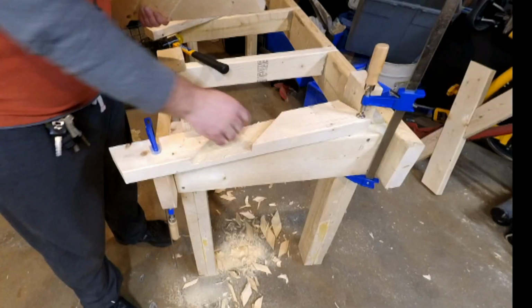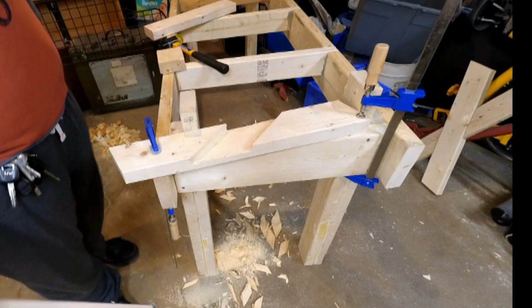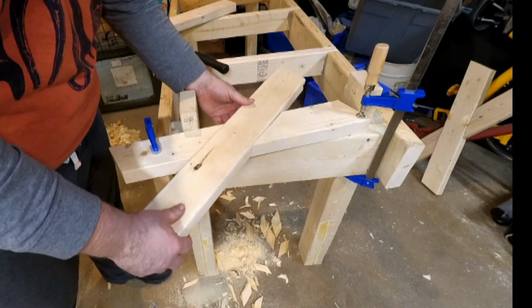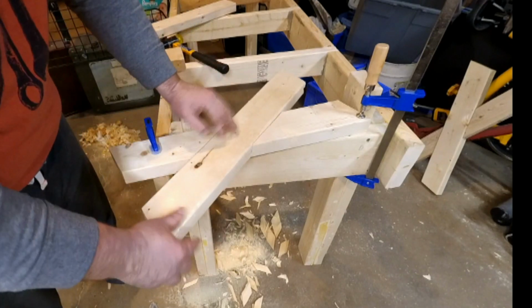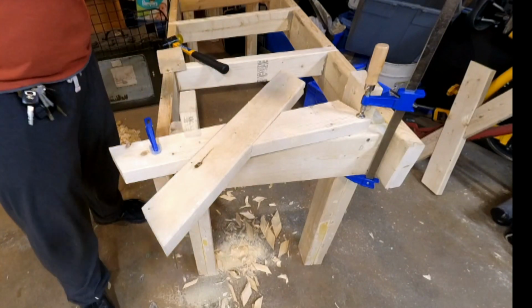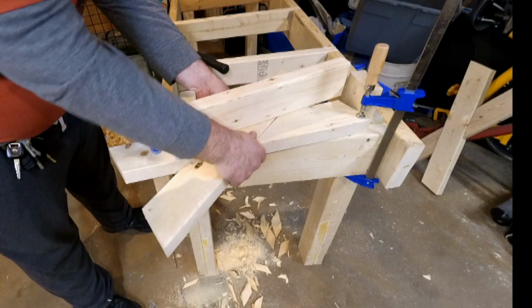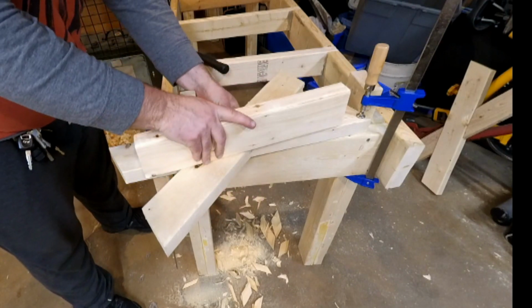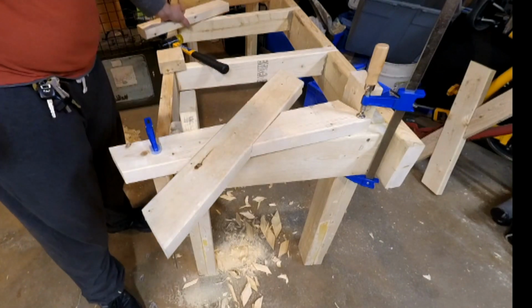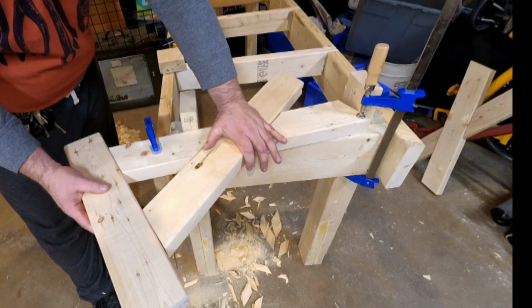And we'll be back. We're ready to try our crisscross applesauce, double half lap joint thing. We got her all snagged out. There, and you can see it's kind of woggly, and that's okay. That gives us lots of room for construction adhesive. And just straight edge her across the fit here. That's not bad at all. I might take just a kiss out of this side here, but it doesn't really need it. Oh yeah, straight edge, there. Wonder bar, so that's going to work.